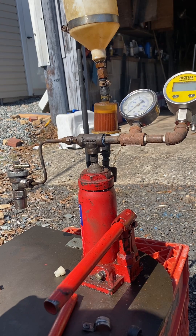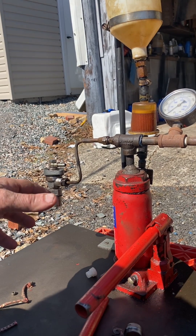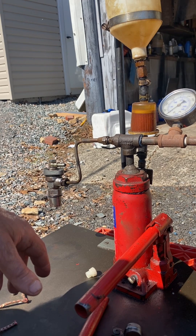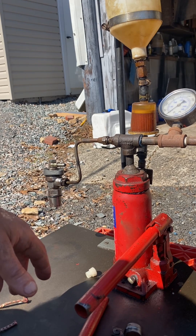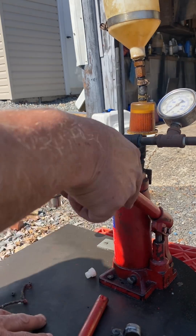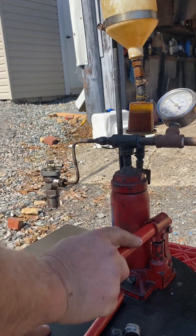When you pump it up and the injector finally hits its pop pressure, it pops. Right now I have a problem with this injector — it's from a Yanmar 1GM10 diesel. I rebuilt the engine with new rings and bearings, but when I tried starting it, it would crank over but not start. I pulled the injector and put it on this test apparatus. The injector should pop at around 1900 PSI.